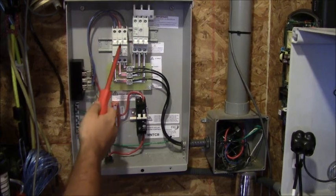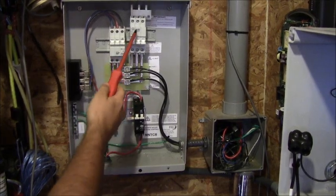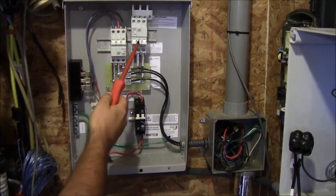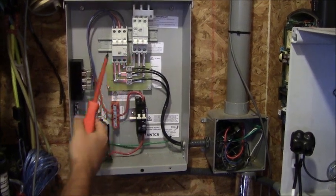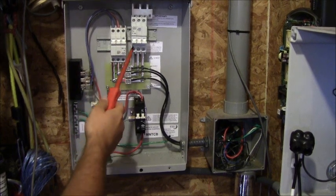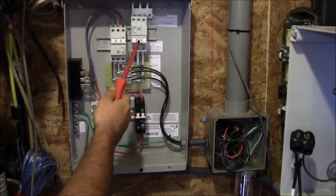It's going to hook into these two circuit breakers. The one on the right is actually mounted upside down, and this is just working as a stop switch for the turbine. If we want to short circuit the turbine and turn it off to do some maintenance, all we have to do is flip this switch down.